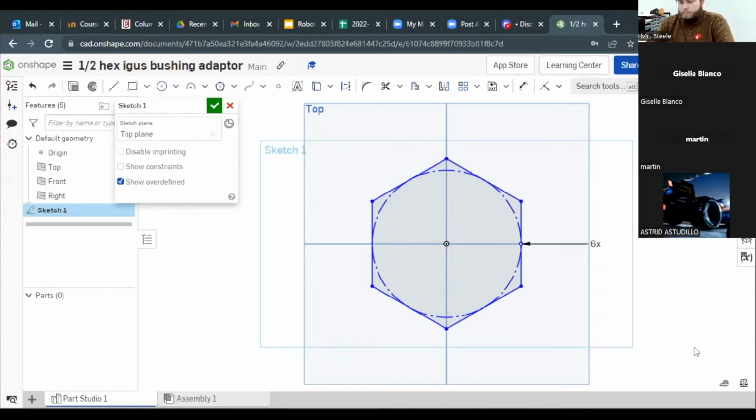Okay, so moving forward, we have a dimension tool, and a dimension is a label that we place on objects to tell people how to make it or how big it is. If I were to try and define this part here, which we have done because it exists in a 3D printed form, meaning somebody designed this at some point, there is a definitive size to all of these holes on it. There's a definitive size to the outer edge here, and a definitive size hole to hole. All of these are labels that were likely placed in this software to then be able to stretch up a model in this plane. So it was designed like this, and then it was stretched outward and then became this three-dimensional object. We want to put as many labels on stuff as possible, as long as the labels do not over-define the object. We need the right number of labels.